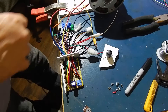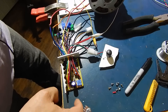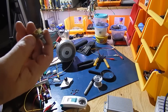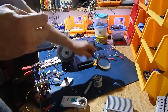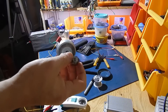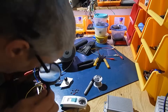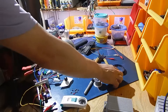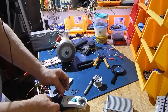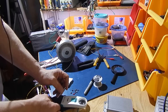That IC controls the amps. So what we're going to do is cut that trace and then add our pot right in there and see if it makes any changes. This is a 50k pot, so it's a little too sensitive — as soon as you turn the pot it just shuts off. But if we put the smaller one on I'll look up the rating once I'm done, but I will show you that it does change the milliamps pulling through it. It actually changes the speed too, so there is a difference being made — it all depends on the pot being used.